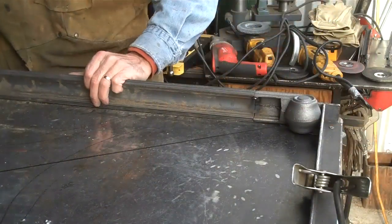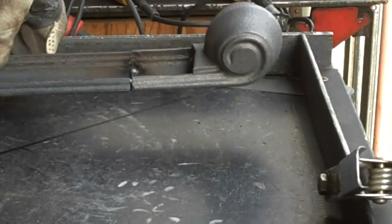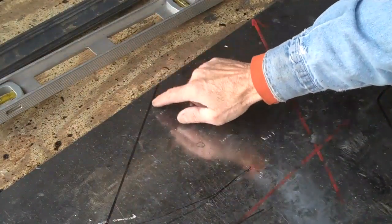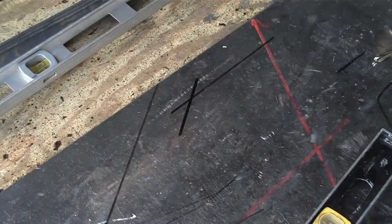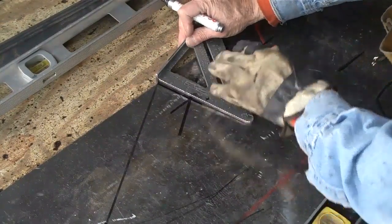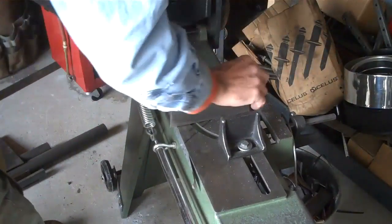Now let's check it — make sure they're nice and straight. Alright, let's weld these up. Here's a real easy way to figure out the angle we want. This is the angle that we pulled — the angle the railing will be going up the stairs. When it hits the top of the stairs, it needs to go back to level. I'm just going to take my level and mark little A's on both of these, connect this point to this point, and that will be the angle we want to set our bandsaw on. I'll just mark it like this, take the square, line it up, and that's going to be the angle we want — 15 degrees. Next thing we're going to do is adjust the bandsaw so that we cut that 15 degrees.